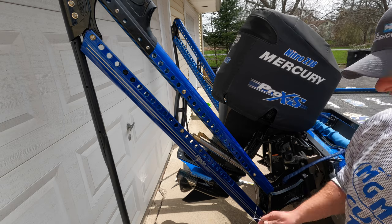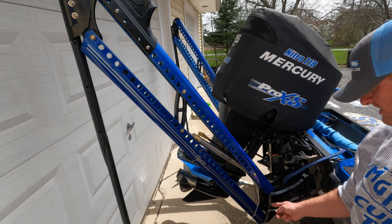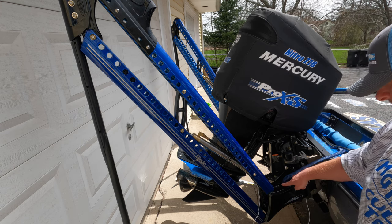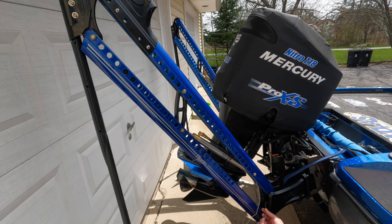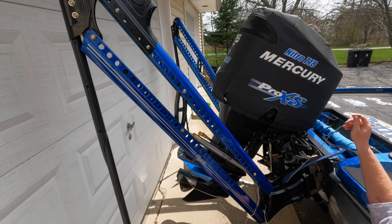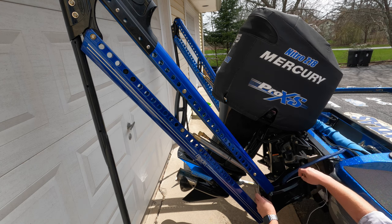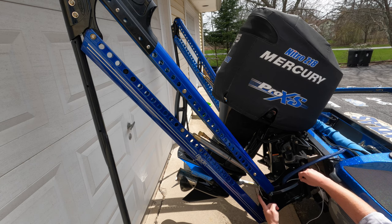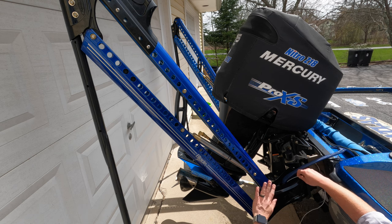I'll put a picture on your screen, but now that we have the wires down here, you can actually see the hydraulic hoses — just follow them up through and pop them out the top where the hoses go. If you put them up through that channel they pop right out here. I'm going to leave a little bit of slack and very loosely zip tie them to the hydraulic hoses so they don't pop out outside the blade when deploying or stowing the Power Pole.